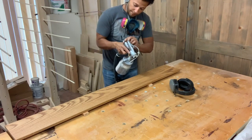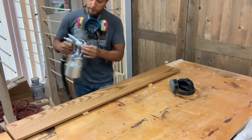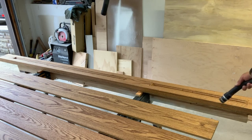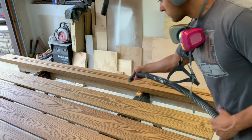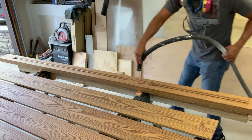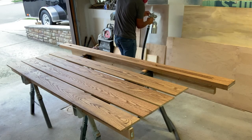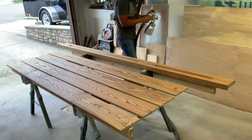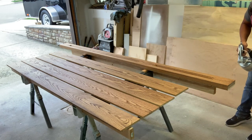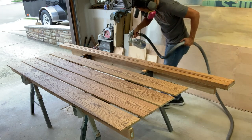Since it's a smaller board, I'm going to adjust the nozzle opening of the tip and have it as a smaller fan pattern, and I'm also going to back off the material a little bit — I don't need as much coming out at once. So let's get the safety equipment on, turn it on and spray. First thing you want to do before spraying your finish is make sure there's no dust on the surface. I'm just using an air hose here from the unit and blowing off any residual dust.